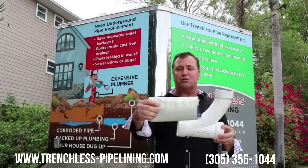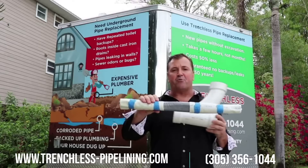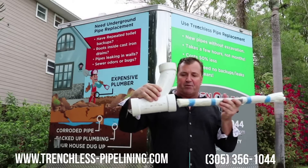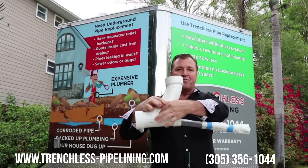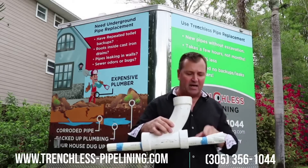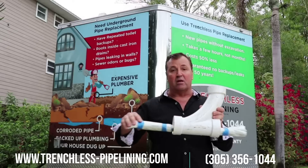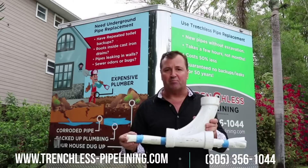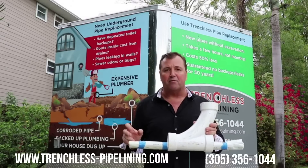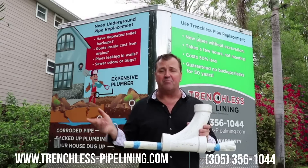Once the lining has been measured and cut to size, we bundle it together with painters tape to hold it as a smaller profile than the pipe we're relining. From the outside at the clean out, we pull this into the pipe using a cable until it lines up with the connection, then we inflate the balloons for four hours. The balloon pops the tape off — the tape stays between the cast iron and the lining and you'll never know it was there. After four hours we pull out the balloon. Since we had to string a cable through the pipe, we needed a second access point, which means getting into the house — either by taking a toilet off or making a small hole in the kitchen wall or laundry area.